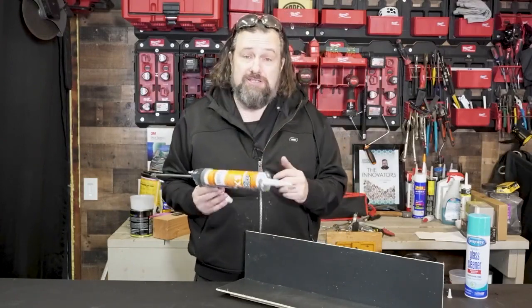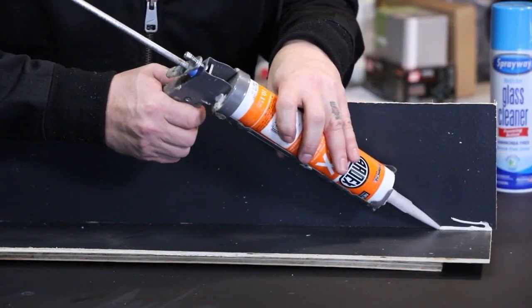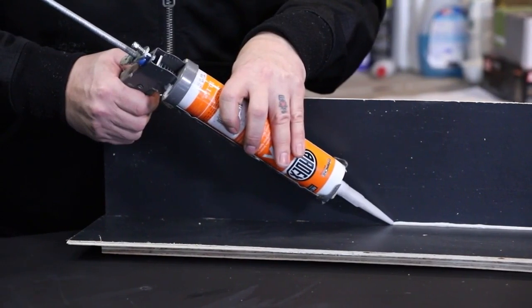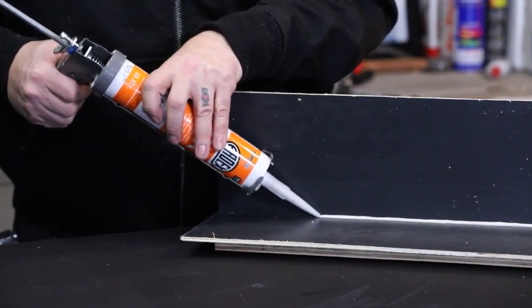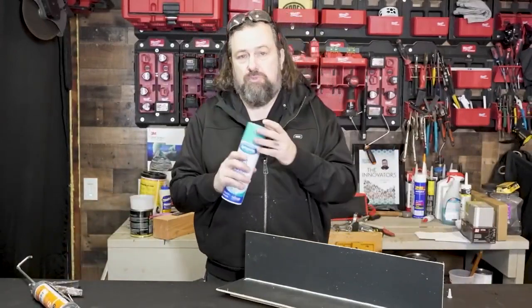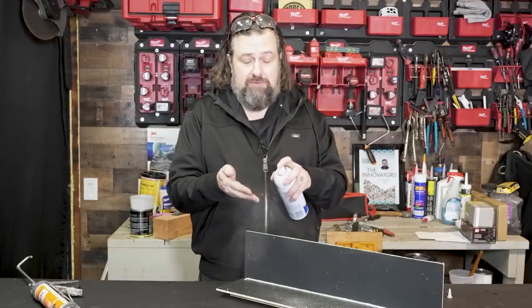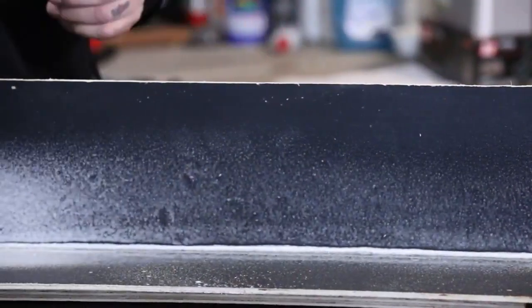You're going to have a hot mess otherwise. So we're going to go ahead and put a bead down here in the corner. What I like to do is just get in here like this and put a nice little bead in here. Then I'm going to show you my trick — spray window cleaner. This is the answer right here. I'm going to cover my hands and cover that bead because I'm going to get it on there, and then come across here. This is a surfactant, which means that stuff is not going to stick to it.